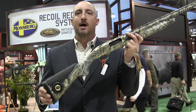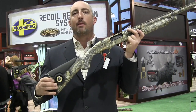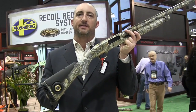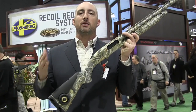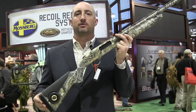This is a weight that's suspended here in this elastomer unit. What's going to happen is that under recoil, this is going to torque, it's going to absorb a little bit of energy, and then release it as it goes — and that's how you reduce recoil. You take the force of the recoil over a longer period of time, and that's how you reduce felt recoil.